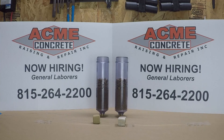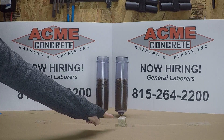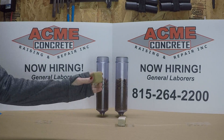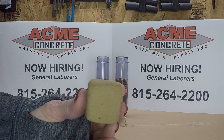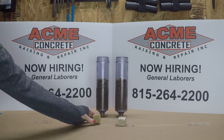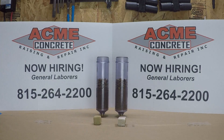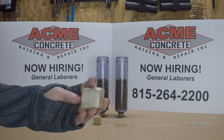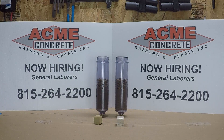Erosion is one of the top reasons concrete drops or sinks. So what's the best material to raise concrete and help prevent it from dropping again — polyurethane or mudjacking mud? In a controlled environment, we're going to test the effect of water erosion on equal parts of both materials. Using mudjacking material collected from the mudjacker's worksite, we formed a cube and allowed it to fully dry for maximum strength. Mudjacking mud takes 24 to 48 hours to fully cure. To ensure a fair comparison, we selected a same-sized cube of fully cured polyurethane, which takes about a half an hour to cure.